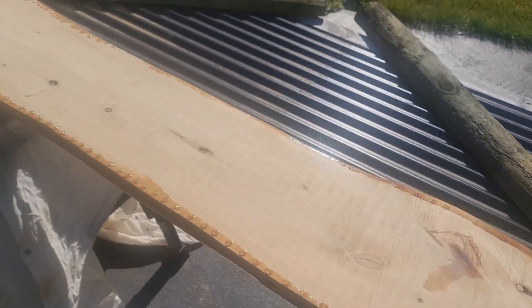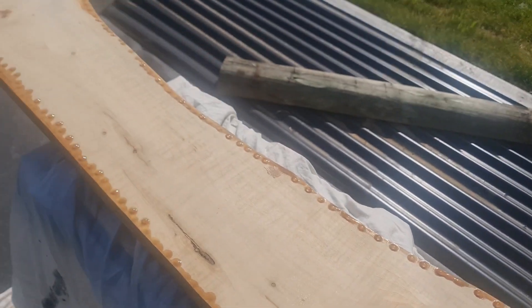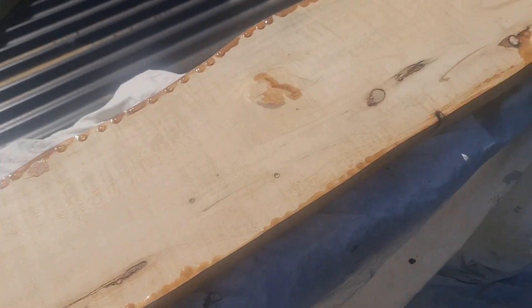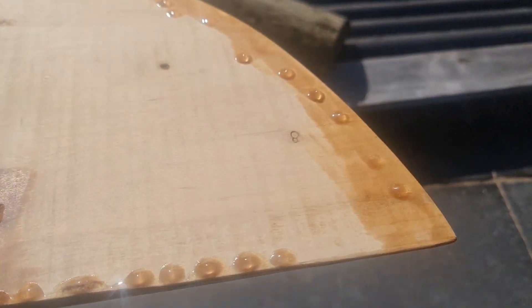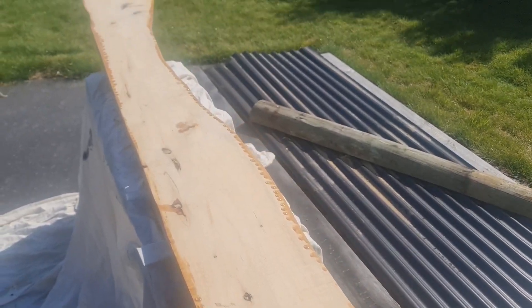This is the flip side. You get all these bubbles forming from the epoxy just drying, so they all need to be ground off carefully and smoothed off. The underside needs to be sealed as well — you can't have exposed timber with an epoxy-covered top, otherwise the timber will naturally want to bow all the time. All these bubbles were removed and the bottom side was painted with a paint to seal it.